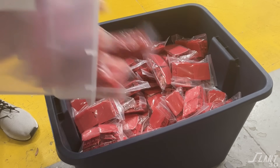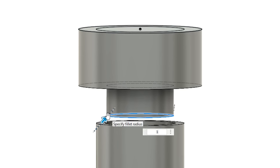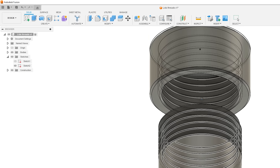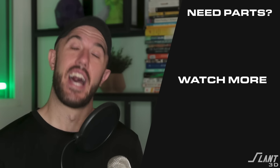Hopefully that gives you some context of ways of attaching lids to the top of parts. This really optimizes the cost of the part in production and ensures better quality output. Simple chamfers and fillets can make such a big difference in the quality you receive. When working with clients who want 10,000, 100,000, or 1 million parts, every single optimization — every single 1% — adds up a lot down the line. So make every tweak you possibly can to ensure the parts you're making are as high quality and as efficiently made as possible. Have a great day, everybody.